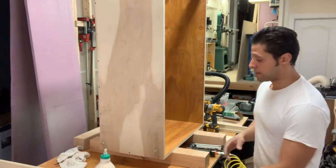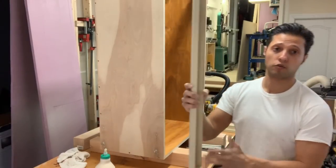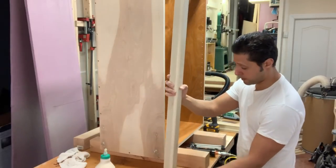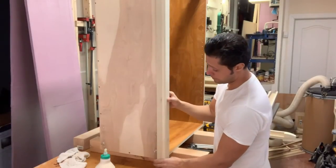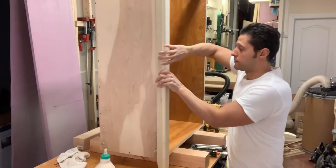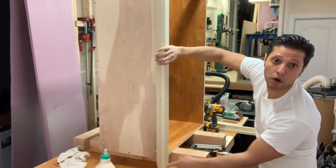I stood the cabinet up now. You remember when we made the legs and I made that little extra block there as I made the curve, and I told you it was gonna be a little cradle — well, that's what's gonna happen here. This is gonna support the weight of the cabinet bottom, but also hook on there, tack in place, glue it up, and then screw it in from the inside. That'll not only cradle it but give it the look of a face frame with the curved leg on both sides.